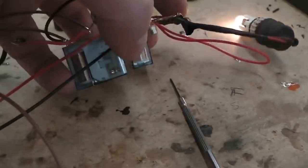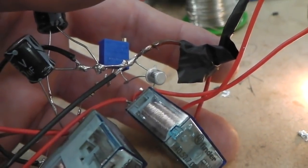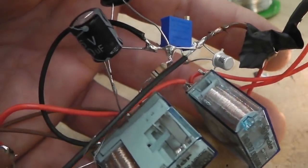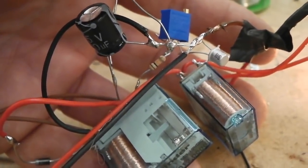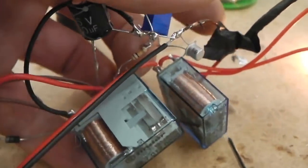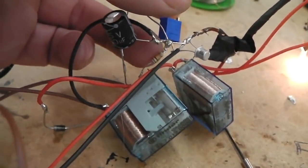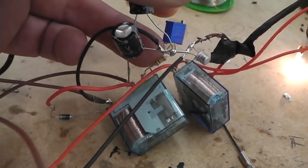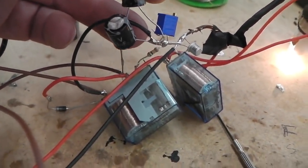That's how it was. There's the transistor. That blue thing's the variable trim pot, the thing that can adjust the time delay. The resistor you see just in front of it, that little thing with black stripe, orange stripe, it's a 10k resistor. Those colour bands on the components represent the value of the resistor. A bit like a little tap on your sink. It just restricts electricity going through it, and the different colours denote the restriction or the resistance.